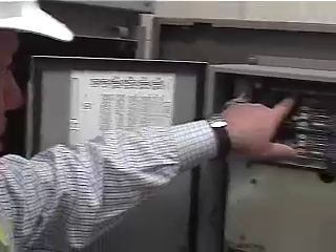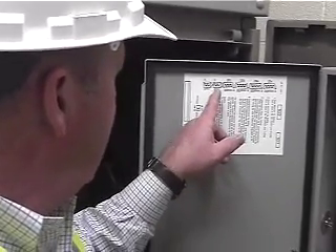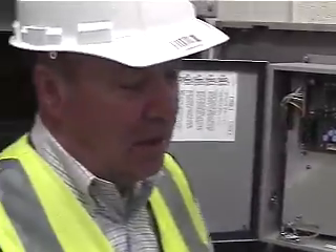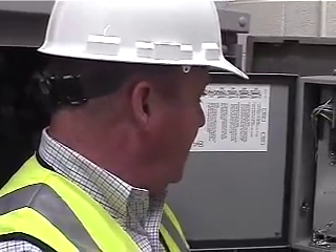The same thing with the ground is set at 30 plus 10 for its default, so it's 40 amps on the ground. The instantaneous trip has no values put in there; that's for high-current faults so that you don't go through the timing curve, which is an E curve. The EF cards — one for phase and one for ground — electronically simulate an E power fuse time-current curve. That allows for coordination of upstream and downstream devices, and that curve information is in your manual if you ever need it for a coordination study. Those are the only settings you have, so it's a very simple device.